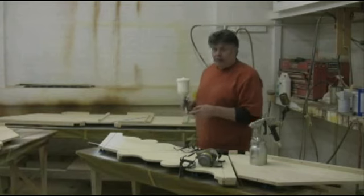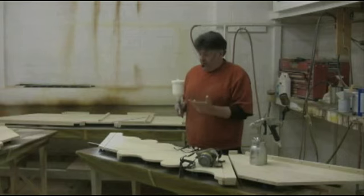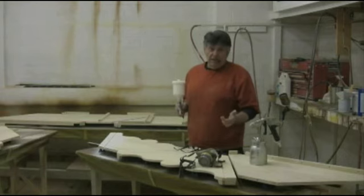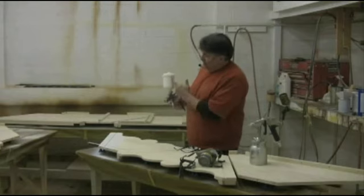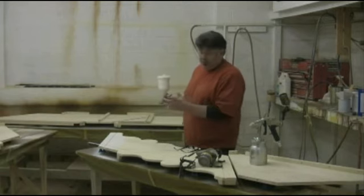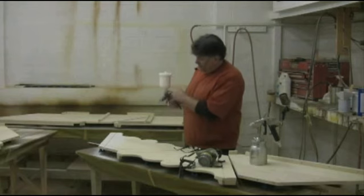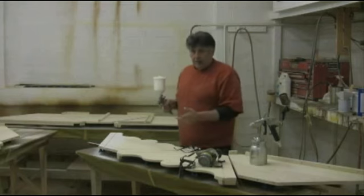This is a 1.4, which is pretty fine for water, for a heavy base product, and this is. Again, I could thin it. But because it's gravity fed, I've got good fluid down on top. It's just as it implies, it's the weight of the fluid that's pushing it down through here to the needle so that I can get it out.